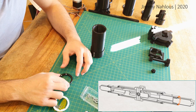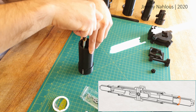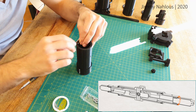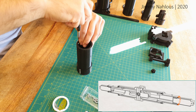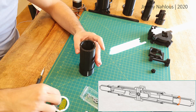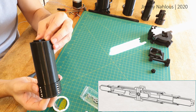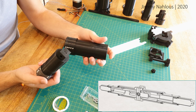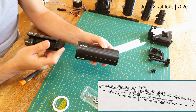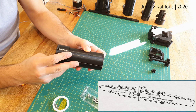I've placed four five millimeter ball bearings inside the cap of the secondary tube. These will act as a guide for the outer arm to move through, also held in place with one millimeter set screws. I will be redesigning this to have a male-female part again as it'll probably help with the weight. Here I'm just test fitting them — you'll notice I've labeled these parts as 'up' so I know which way they go, as well as, in respect to each other, how they should sit.